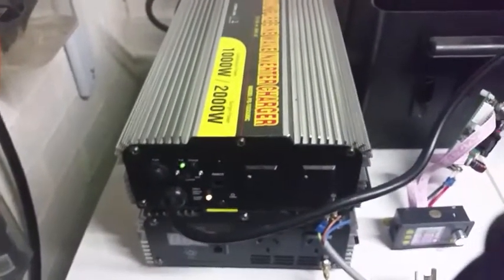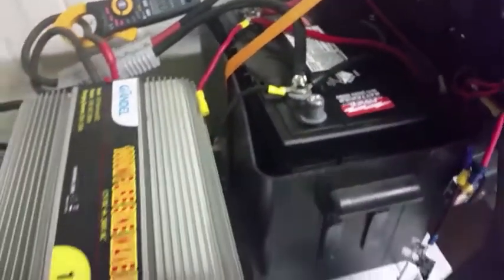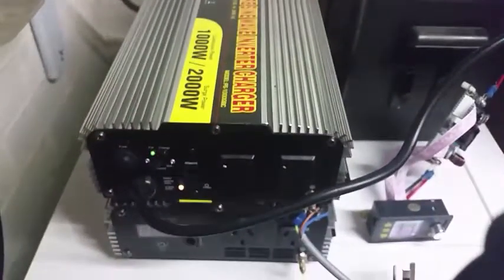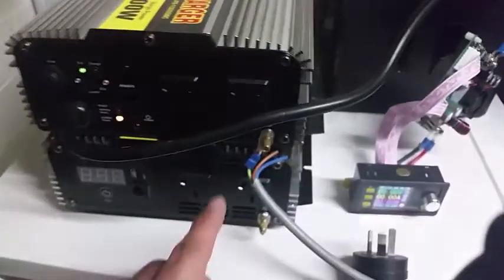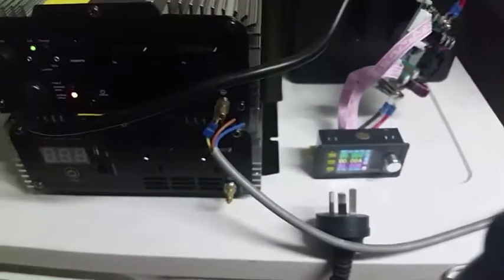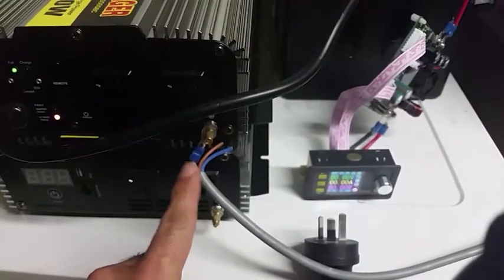As I mentioned, this inverter is actually in charge mode at the moment. It's putting about 600 milliamps into this battery, just trickle charging it. And the inverter, because it's a charger, also has a power cord here as you can see, which goes up to my power board up there. There's also another cable I've just rigged up, because these inverters really do need an earth, so I'm just using the earth cable there and plugging that into the power board as well — earth to ground through the house.